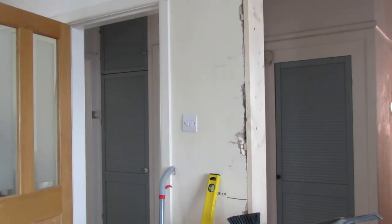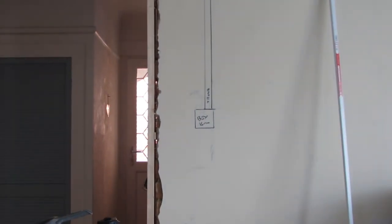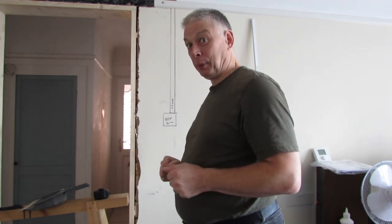Because the light switch is being moved from that side to that side, so there's no real contention. The additional bonus of that is that the wire coming from the light fitting over here has actually got a shorter route to get to here than it did to get to there, meaning I'm not putting in any new wiring — I'm just shifting existing wiring so I don't have to get an electrician involved. Building regulations say, as long as you don't put in any new wiring, you can re-terminate a box on the wall quite happily.